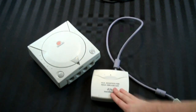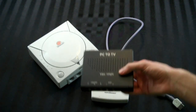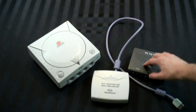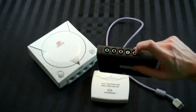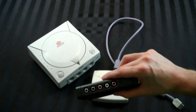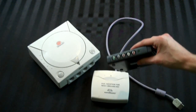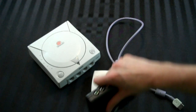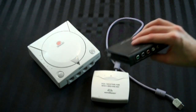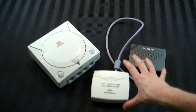So you have this VGA adapter. And like I said, it does 480p, which is nice. But what if you want to go nicer? I got this other thing and showed a video about it — you connect your VGA adapter to it, and it outputs through component cables, which are red and white for audio and red, blue, and green for video. This would give you 720p and 1080i outputs. I always used it at 720p. It basically takes the 480p signal and upscales the image a little bit. It's nice, but not amazing — definitely better than composite, but I think we can go better.